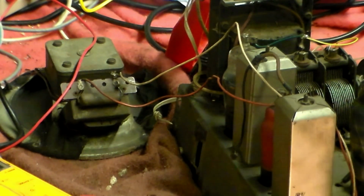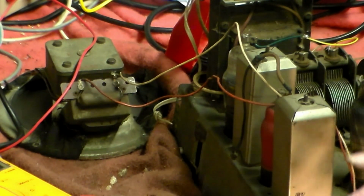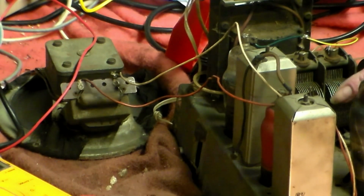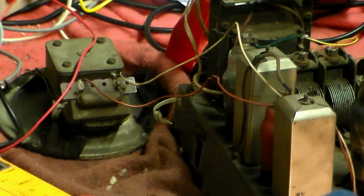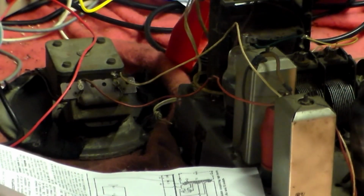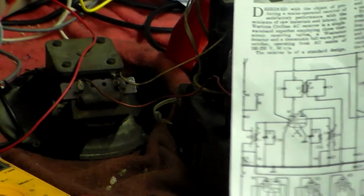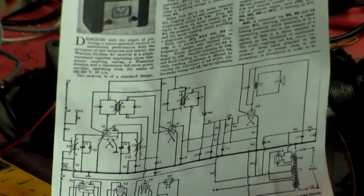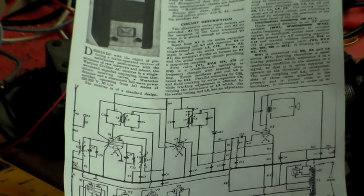And going underneath there, well, I'll look at the aerial circuit as well and find out from that why it's so quiet. I noticed actually looking at it that it doesn't seem to be getting 5 Live. That's interesting because 5 Live is normally very strong round here, and also it seems to be more powerful at the bottom end of the band, the high frequency end of the band, which probably looks to me like it could be a capacitor. So I think, look at the circuit here. I've tidied the circuit up for you there, yeah. If you look at the circuit there, you see, I would look at L1, L2, and possibly R2 as well.